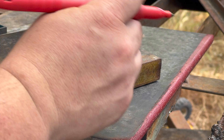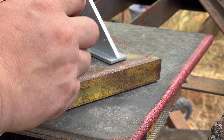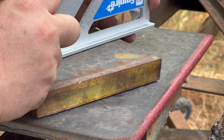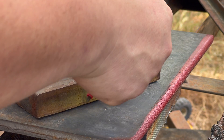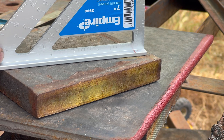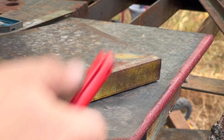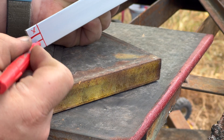Just give myself a line. I'm going to do it on both sides and also come down to the 45 end and mark roughly half an inch, and then we're going to use those as guidelines to come in with the grinder and cut this way, trying not to quite hit the surface, then flip it over and come in the other way to take out those little squares at each corner. Just to make it easier I drew it on the outside as well — those are the areas we're going to cut out.